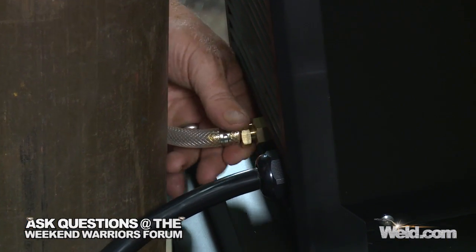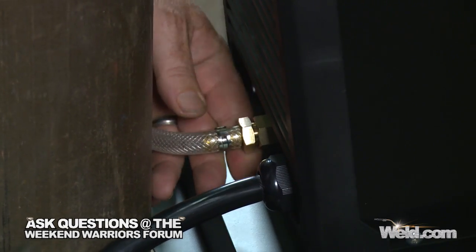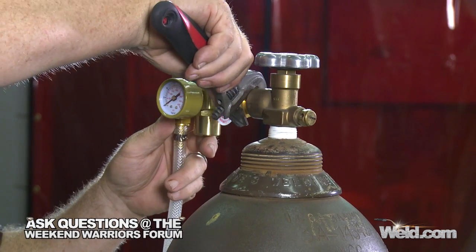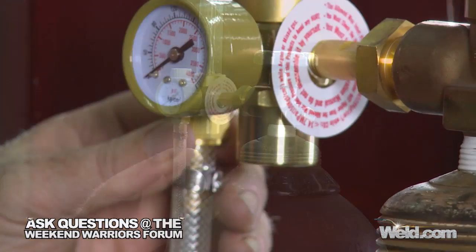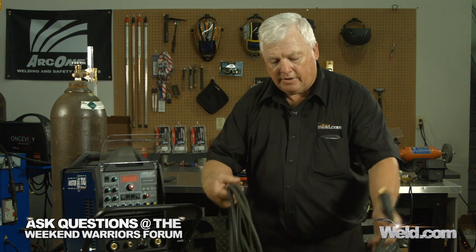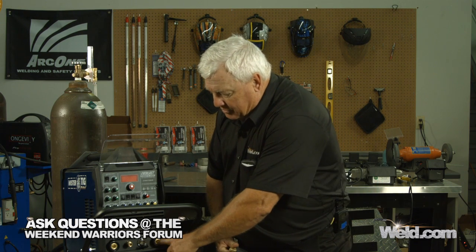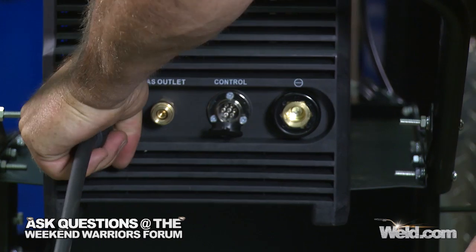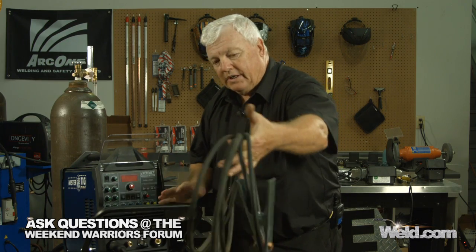The first thing I'm going to hook up is the argon line on the very back. Thumb tighten it and then use a wrench — just snug tight. Then I put the argon regulator on and tighten it as well, and finish with the hose. Now I've got a complete argon system, all tightened with fittings. Next I take the ground — this is one of those things where you have a 50% chance of hooking it up incorrectly. This plug is for your TIG torch and this one is for your ground. If you accidentally get it in the wrong hole, when you start to weld you're going to see your tungsten disappear up into your cup — you just got the polarity reversed, so switch your leads back.